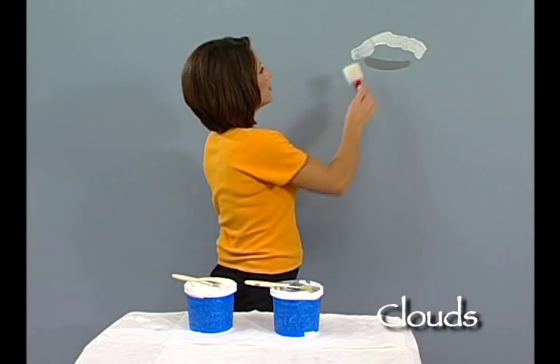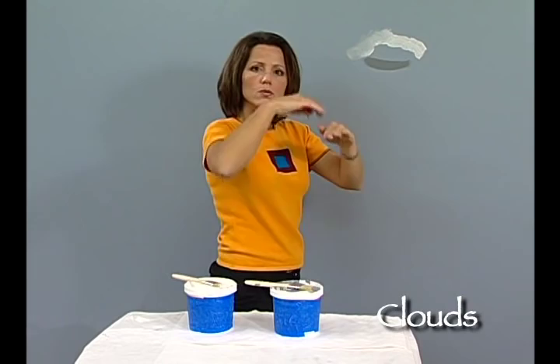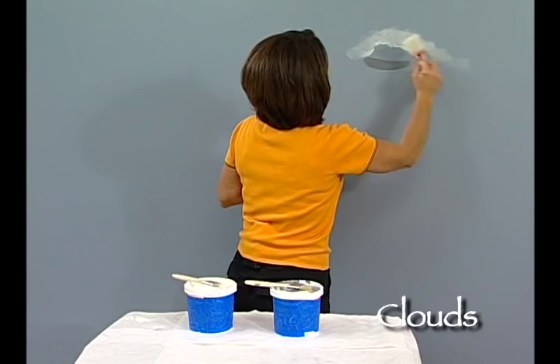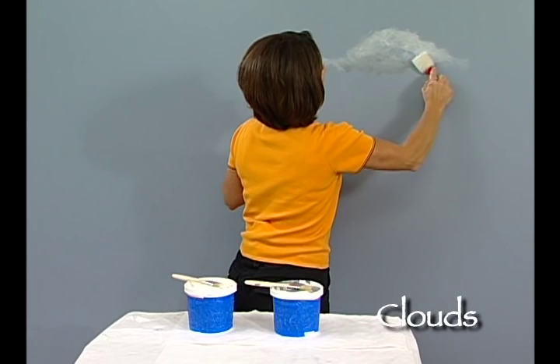Then take the little woolly and begin with the top portion of the white glaze, tapping and jabbing through it so the top portion gets real ripply and jagged looking. The glaze goes a long way and will spread out. Then tap it through the middle and blend it the same way with the gray glaze.